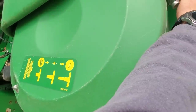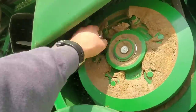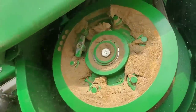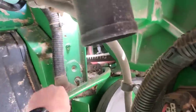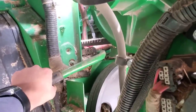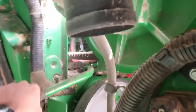We need to change our straw chopper speed, so open up this cover and shift this handle — just push it all the way in, just like that. And then we need to shift our rotor into the low speed range. Just push that handle in; I've got to use two hands to try and get it. Rotate the pulley a little bit so that it'll slip into gear.